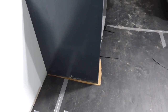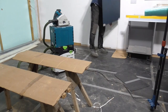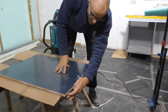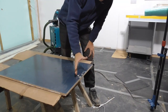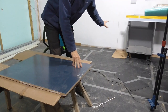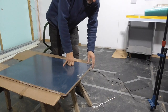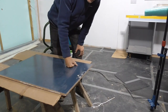I'll now take that panel off and put two coats of PVA on the bottom edge. That will help protect it, because hopefully not too much moisture is going to get spilt on this wooden floor — otherwise they're going to be in all kinds of trouble. Swollen end panels will be the least of their worries, but we do everything we can to stop it swelling up, because get any water on this and it'll just explode.